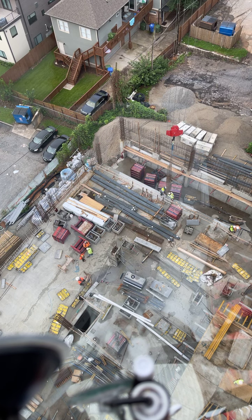It's always good to practice this, because if you're in the blind and you're trying to set rebar columns, you can just basically look at your LMI and know if they're jammed up down there. They keep telling you to cable down, you know that you can't. So we're at half the weight. We're at 163 pounds. So I'm going to give them a little cable down, and it is moving, but something is still jamming them up. Okay, we're down easy. So we've gained weight.